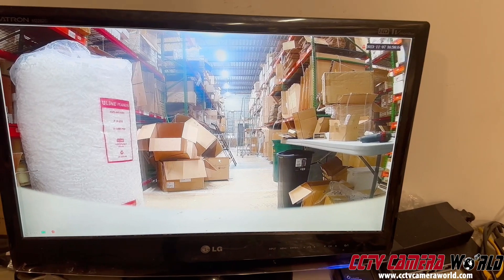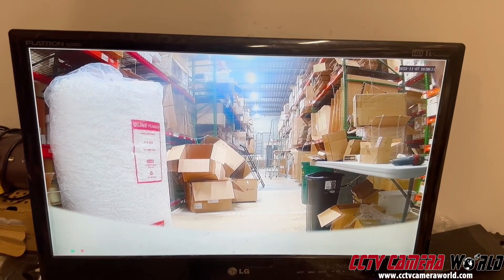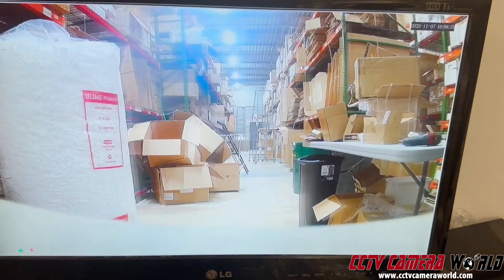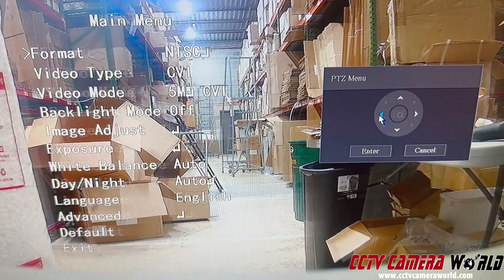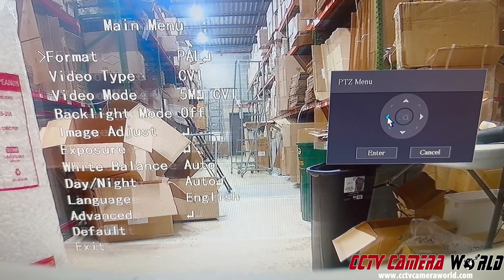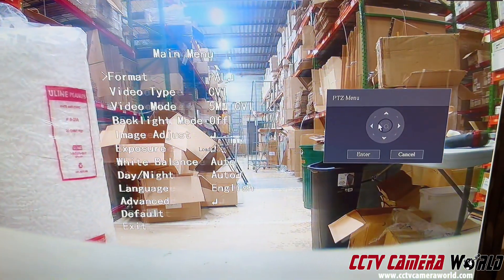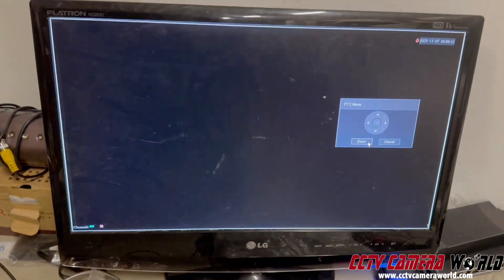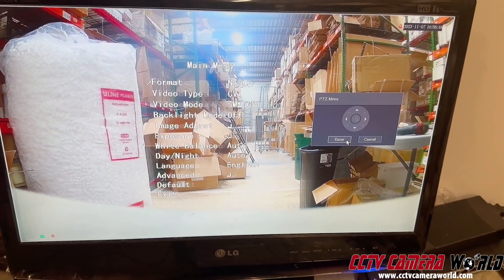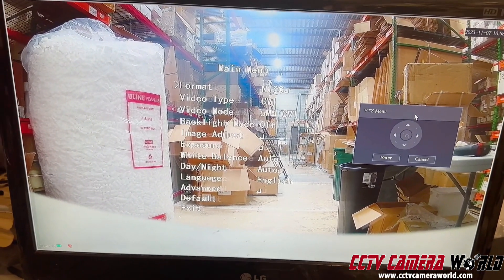So if you're not getting a good, clear picture even on the old style cable, then you have a signal mismatch if you're getting black and white video. You need to make sure your DVR is set to CVI. The cameras are always set to CVI and sometimes they're PAL. So if that's a mismatch because of how your DVR is configured, you can go into the camera via PTZ controls and set the format to PAL — or if it's PAL already, change it from PAL to NTSC. This menu will only come up if your camera and your DVR are on the same signal type, so CVI and CVI. If your DVR is on AHD or TVI, it won't talk to the camera unless the camera is in that mode or the DVR is in the correct mode as well.